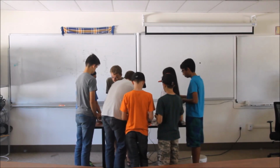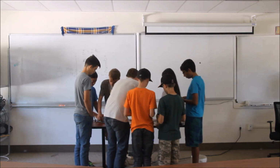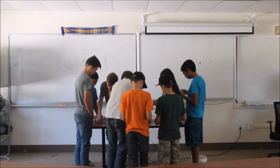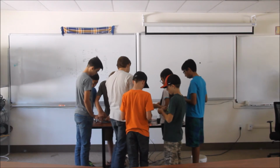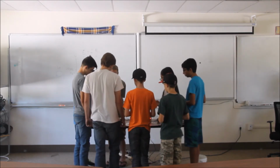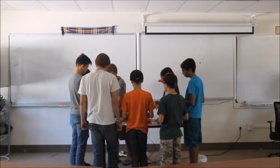But if you want to see the current that's going through here, we can take this little red part out. We can switch this to milliamps right here, and you can connect it. It's 3 volts. That means it jumped down from 5 volts to 3 volts.